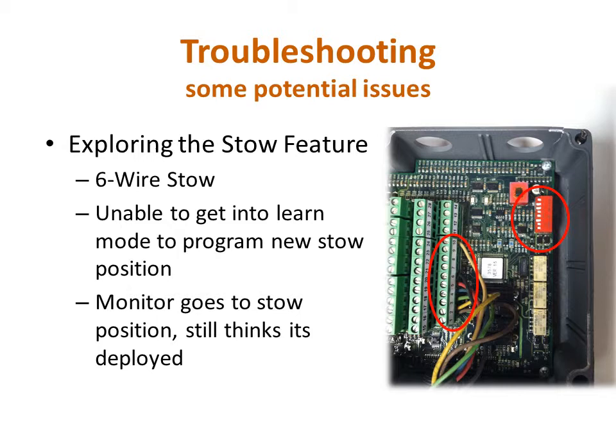This next condition is tied to specific stow positions. For instance, if the monitor is mounted under a ladder and is stowed with the nozzle tucked up against the underside of the ladder, and the monitor goes to its stow position and either generates an error or doesn't turn off the stow light, it is likely because the stow position that is programmed is too close to the hard stop or limit of travel. If this happens, simply relearn the stow position, but back off slightly from the hard stop.